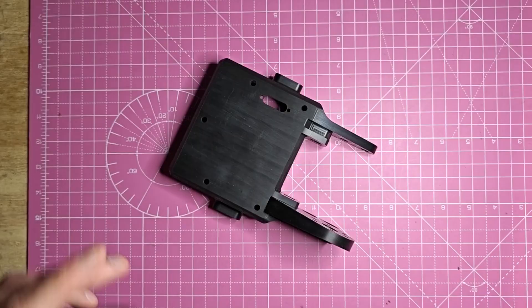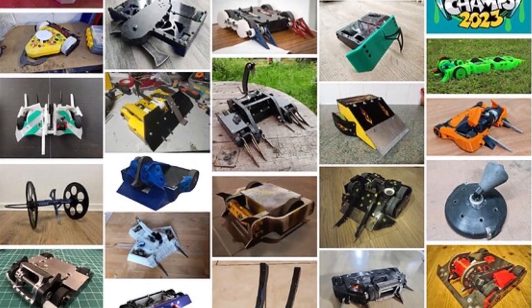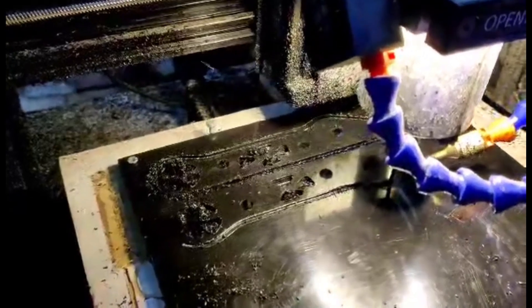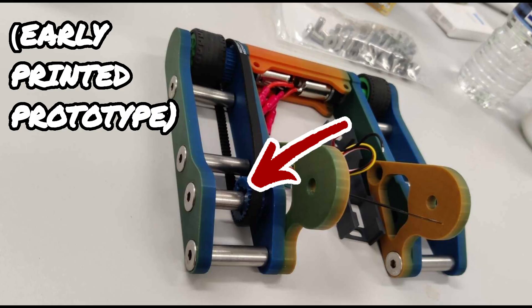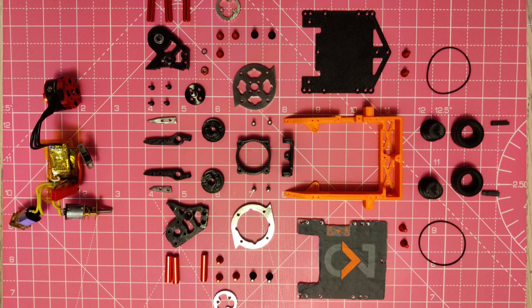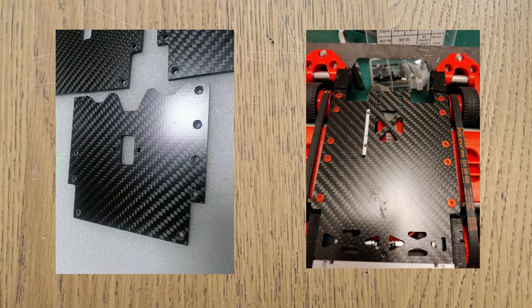This all started in 2023 when I entered the Bristol Bot Builders Beetle Weight Champs. I opted to use a similar construction method to what I'd used in the first version of the ant weight — HDPE machined side armour and frame rails, held together with standoffs that doubled up as the front wheel axles. These standoffs also provided the mounting points for the front armour package and pivots for the forks. On the ant weight version I'd used polycarbonate top and bottom panels, however here I wanted to stiffen up the assembly so I opted for CNC'd carbon fibre panels in 3mm thickness.